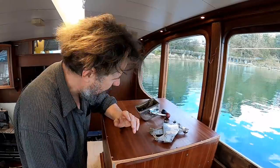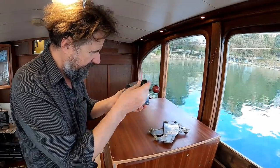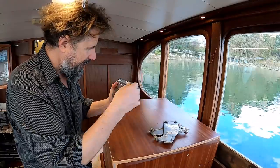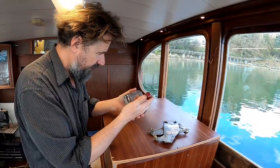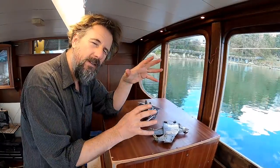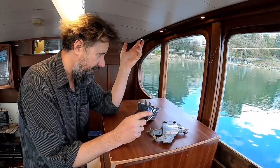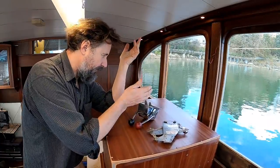I am missing little things like the index balls and springs so that they go click click click on the throttle. I just need to figure out the size of the hole, figure out the length of the cables, and figure out what other parts I need — mainly the clevis terminals for the Morse control cables.